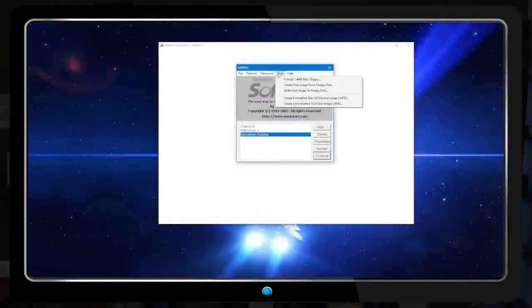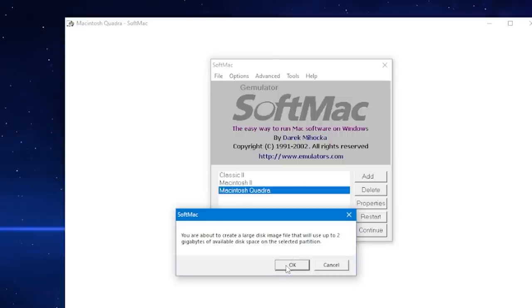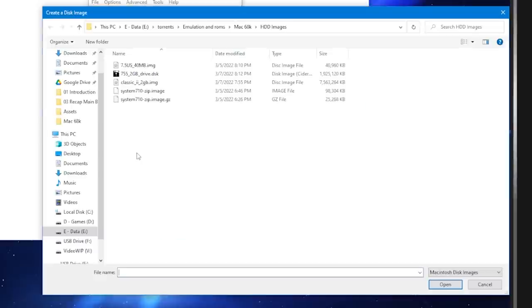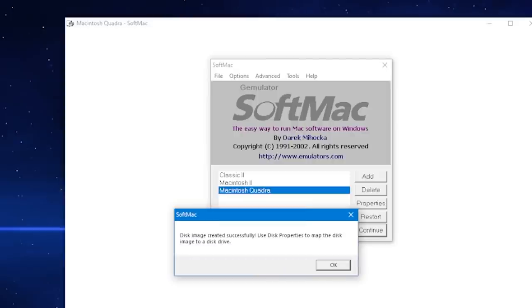So life has returned to this Mac from beyond the great e-waste bin in the sky, but it's still got a noisy old SCSI drive that we can't really do much with. As a temporary solution, I'll install a spare SCSI to SD I had lying around and create a new disk image on my PC using the SoftMac emulator. The step-by-step process is beyond the scope of this video, but I'll link to a guide in the description that I found incredibly useful.